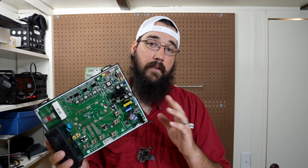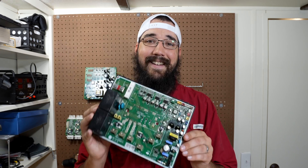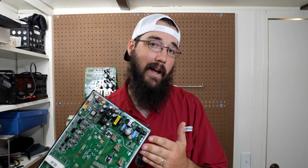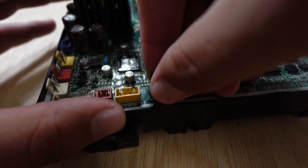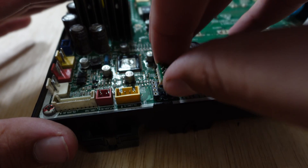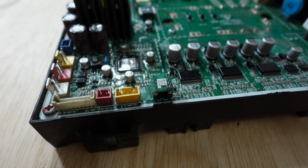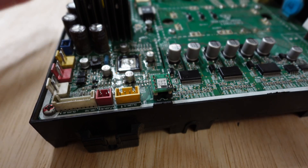Let's discuss a little more about an OEM board. In the examples we're talking about here I'm going to focus on the HVAC side — this is really just an HVAC equipment board. This particular one is out of a VRF system and it is a very purpose-built board, specifically designed for what it's being used for. But that doesn't mean it won't be used in multiple types of systems. An example of this is the EEPROM chip. These boards come with EEPROM chips, which make them more versatile — they can produce the same baseboard but use it in several systems and applications.